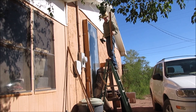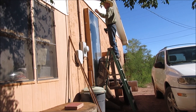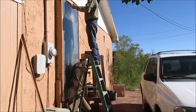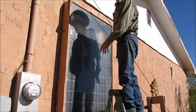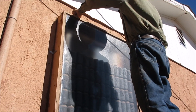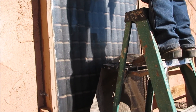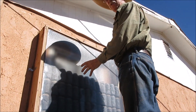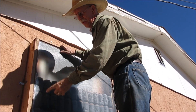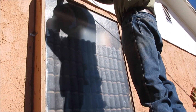That's around three by eight, and we've got glass on it. I've got to shut these vents — these pipes are vents. If it gets a little hot in the summertime, it'll vent out the top. Then I shut them up in the winter and make the air go through our window. Our utility room window's right here. I didn't want to put a hole in the wall because I was just experimenting with this — I can take it off and clean the wall up. It's just tied into the wall with anchors and caulked.